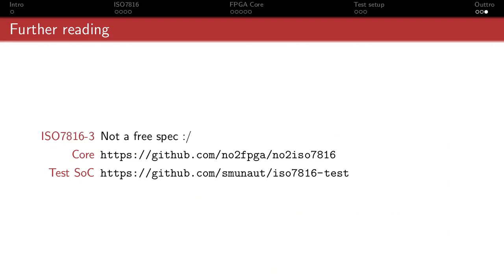Yeah, the main reason is the value of that, if you look at the spec, the difference between the minimum value that the wait timer has, which sort of dictates how much you can pre-divide, right? Because you need to be able to set a value that's like half of the wait, so if it's very short, you need to be able to set it to a very short value.